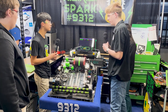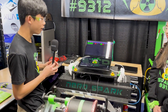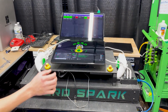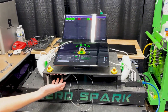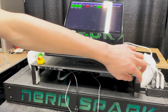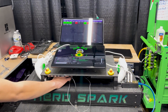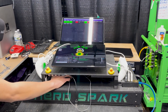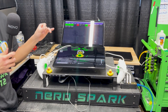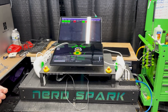Can you tell me a little bit — your driver's station's pretty unique here. Can you tell me a little bit more about what went into that? Our driver's station is the same as last year, but we have a mini PC under here that's connected to two monitors, connected via USB with an ethernet adapter. We're using Shuffleboard right now and we have Booleans that show our camera status and our robot pose as shown by the vision. That helps with our troubleshooting and figuring out what's broken with our robot.